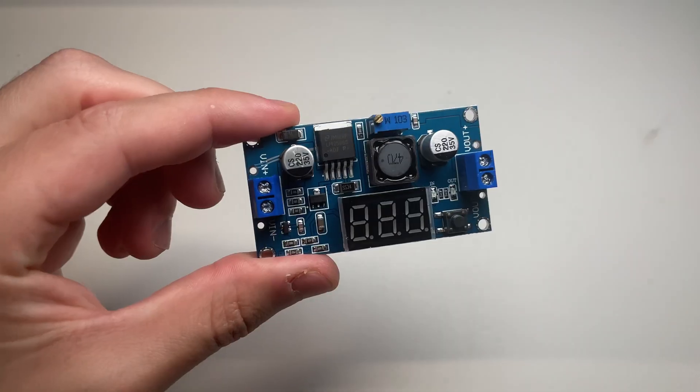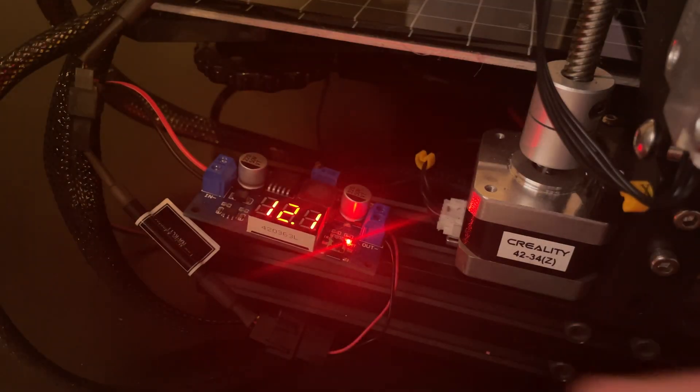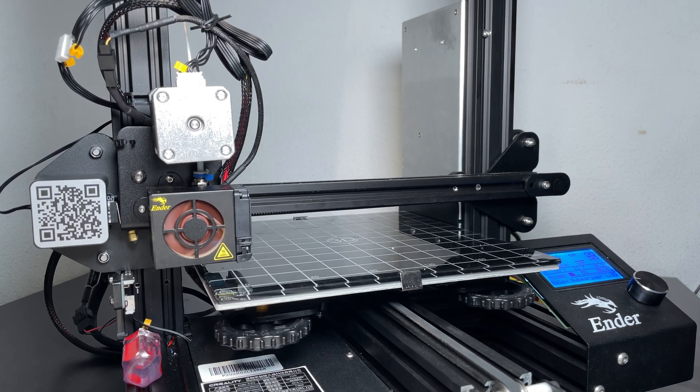The third theory could be due to the installation of the parts itself. For example, in order to install the fans on my Ender 3 Pro, I had to purchase a buck converter to decrease the voltage from 24 volts down to 12 volts to properly power the fan, since the Noctua fan I have installed is powered via 12 volts and you should not go higher than that. This can lead to many complications and additional issues, which would require an entire restructure to provide proper power to all the components. Keep in mind: higher voltage powering these fans means they will speed up and produce much more noise, which defeats the purpose of having a silent fan.